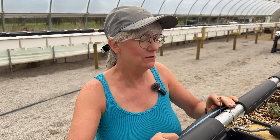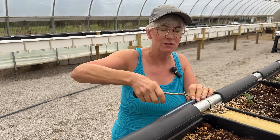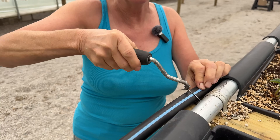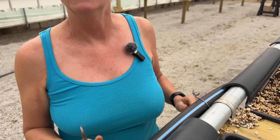Here's the rebar tie I'm going to use to put the pipe up — these things are so handy. We actually use them also for our maple sap lines when we're putting them up at the Girl Scout camp. You have this little tool — you just put it on there, put it through the two loops on the end, and just twist it. Don't want to twist it too much because the wire will break — you just want to make sure it's nice and snug and secure.